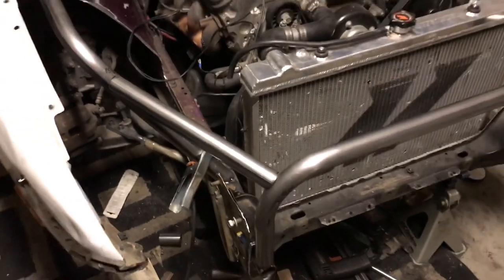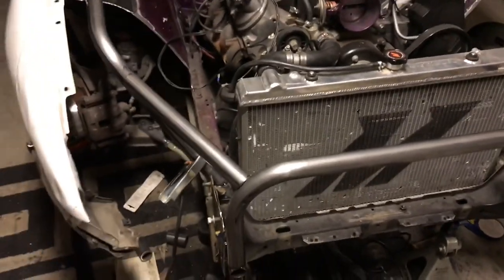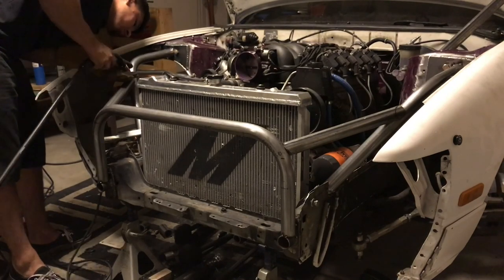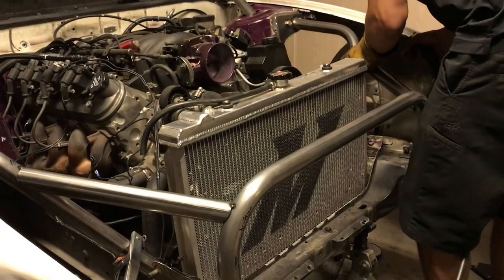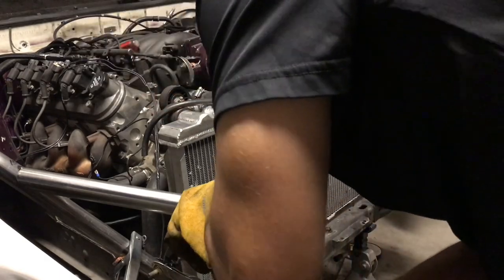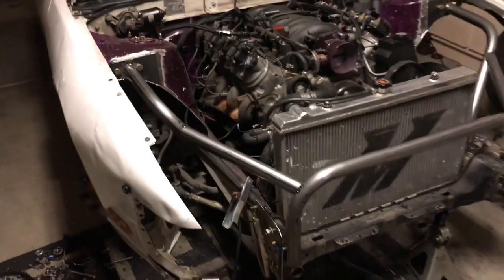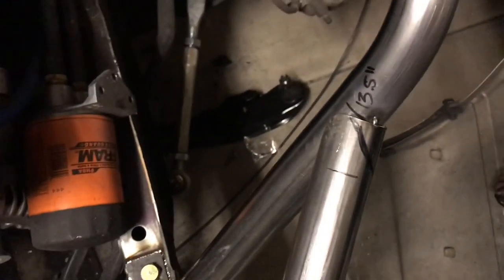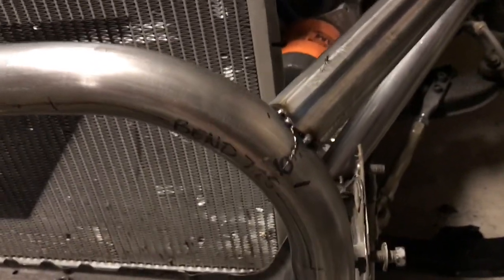Finally, after hours of cutting, trimming, grinding down, and fitting, it's done. This is how this side is going to fit, and it's exactly identical on the other side. Tacked in place. From the bottom of the tube to the top of the tube it's 13.5 inches. And from the very bottom of this tube going up to the bottom of the other tube it's 10.5 inches. That's the same on both sides, and I got the angle exactly the same — here it's 10 degrees, and on the other side it's the exact same.